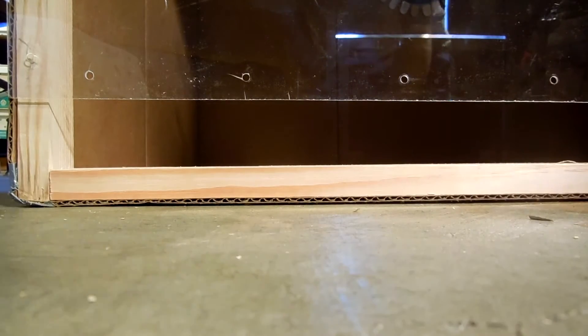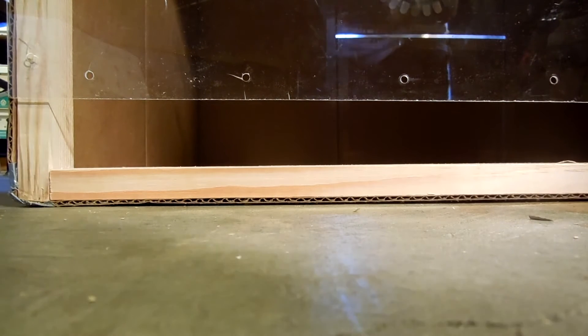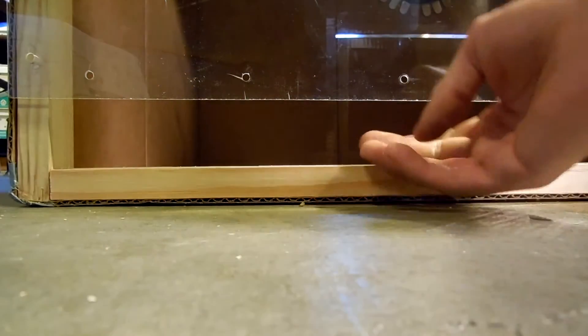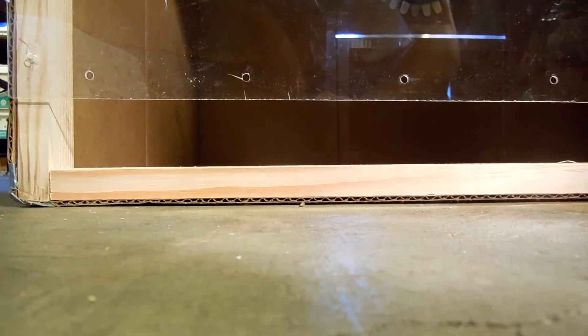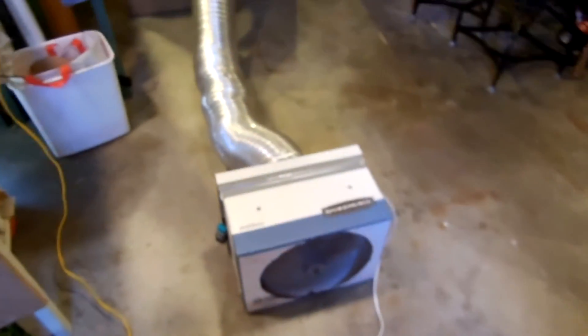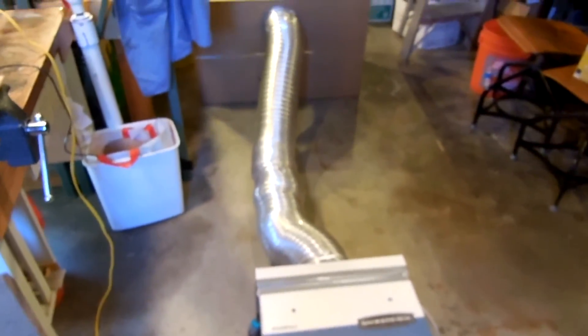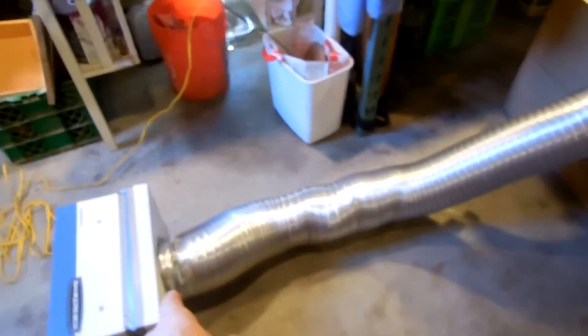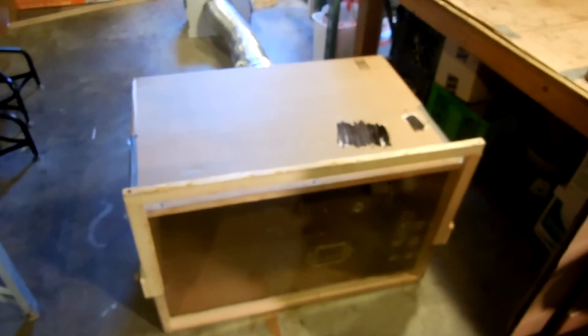Just to demonstrate the flow, with the fan on maximum airflow and the sash pretty low, here's a match burning. The smoke from the match gets pulled straight into the fume hood, even from pretty far away, and I can feel the airflow nicely on my hands — so I'm quite pleased with the performance for the price. The best part is how cheap it was: I salvaged the fan from the side of the road for free, the boxes were free, the only money spent was on the ductwork and the wood — about $0.91 for 8 feet of 1x2 — totaling around $30 for everything. It's very effective and I'm definitely going to be using it quite a bit. Thanks so much for watching, please subscribe for stuff like this, and I hope you have a nice day!